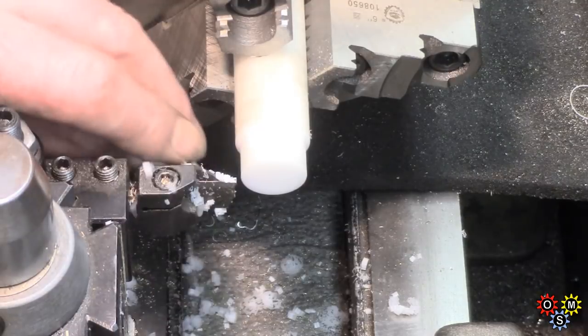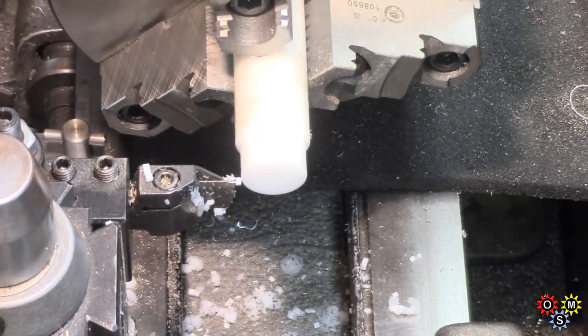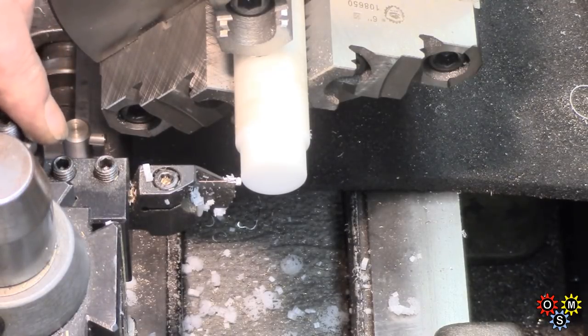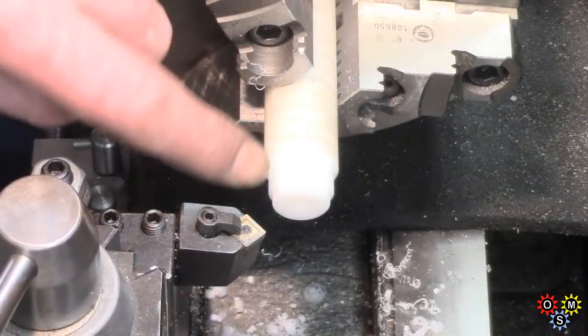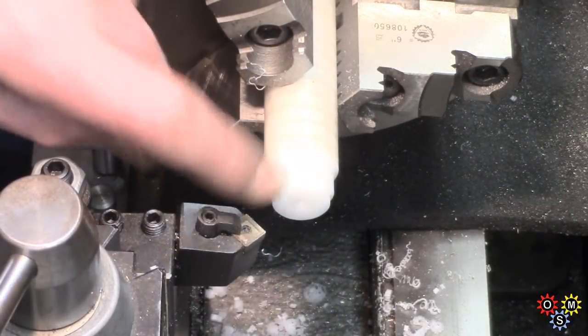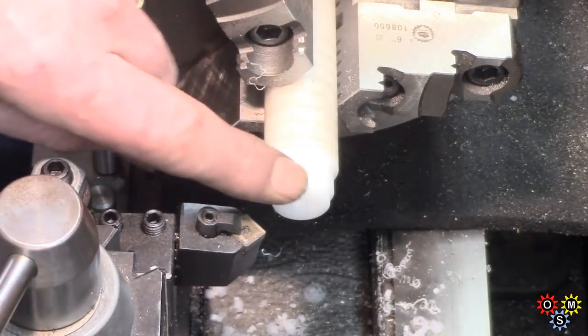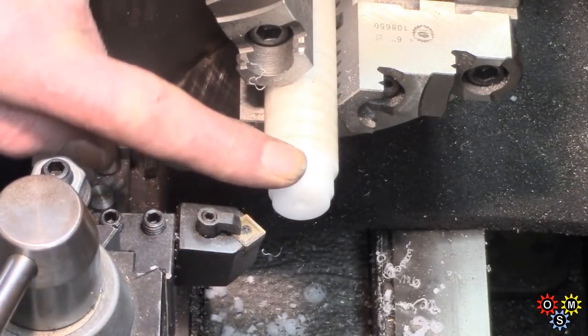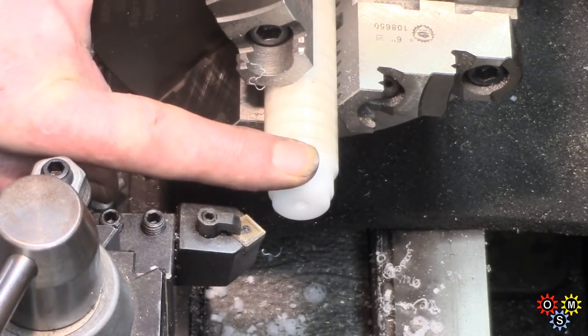And the second one, we've got to put a 4mm hole in it for the brass. Well, just above 4mm actually. Right, put a little chamfer on there, and the guide hole. We just got to part that one off, and then before we fit that, we've got to make the release collar.